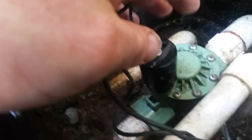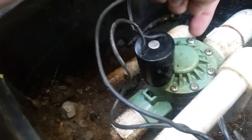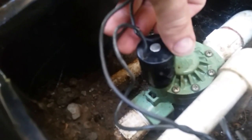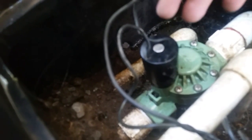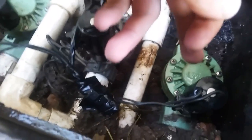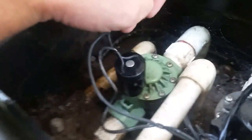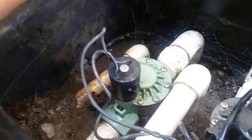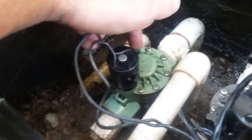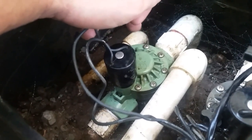This is not our problem. The problem we're having is actually the gasket inside this valve — specifically the diaphragm. That's what's failing, that's why water's leaking past. If your sprinkler wasn't coming on — all other zones come on but this one doesn't — you would have a solenoid issue, meaning it's not getting the signal to open the valve. But that's not the case here. Once the system is turned off, I've still got water seeping out of that sprinkler, and that's because this diaphragm inside the valve has gone bad. Super easy job — the part is like four dollars. I'll show you how we do that.